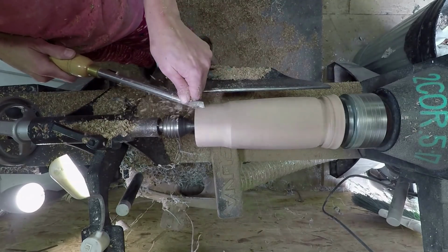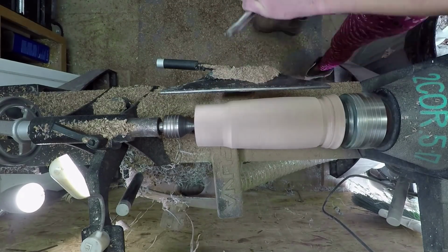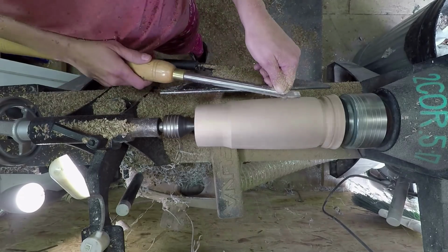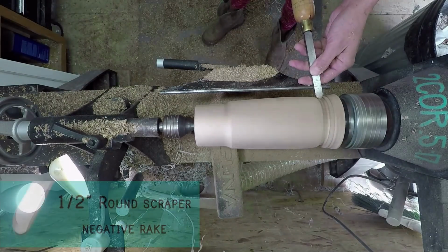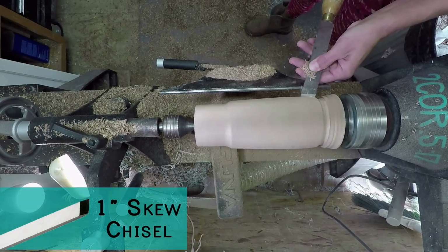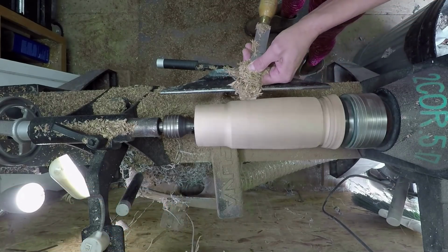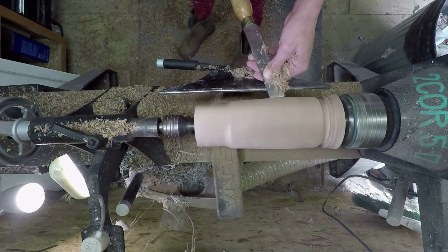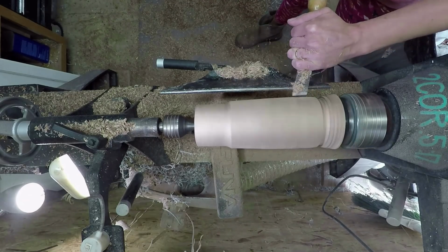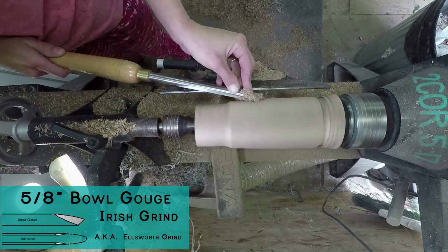to have those sharp kind of features in a piece. And it was real easy for me just to round them out and just make them really nice and smooth, and then you start losing the detail. So that's why I'm just doing shear scraping and just trying to make sure that I'm keeping my lines somewhat crisp, just to keep everything from blending together. So there's not a whole lot of cutting as much as there is just shear scraping with my gouge.